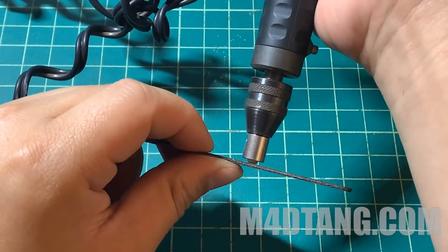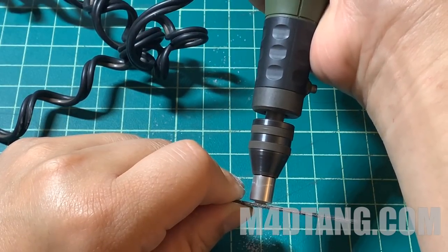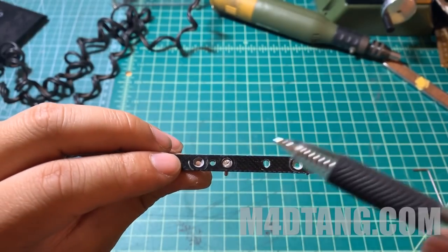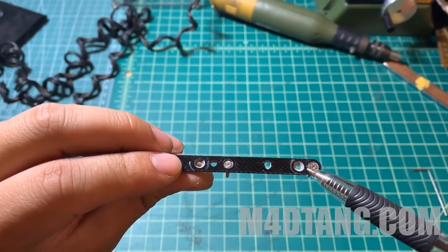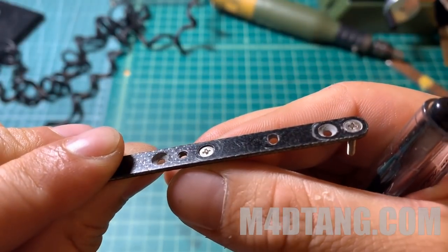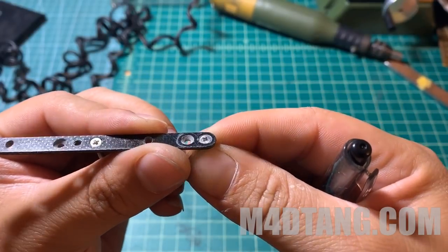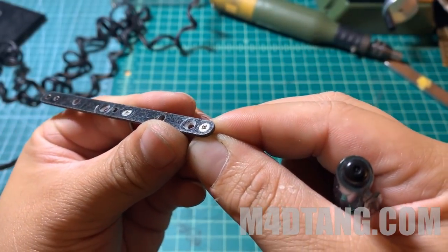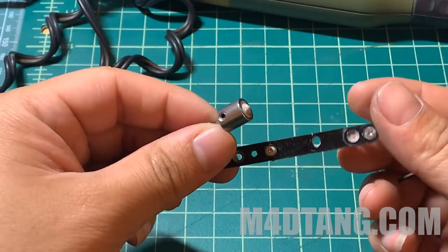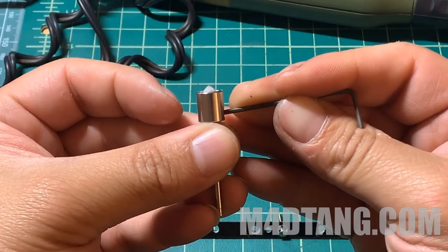Let's take a look at the side view to show you how it works. When you are drilling, the stopper will block you until you reach the destination size. I made two different sizes of countersink holes so you can compare. As you can see, the one on the left is really deep — the countersink screw is buried into the FRP plate. The one on the right is a perfect fit, where the countersink screw stays flushed. So it really depends on how you adjust the stopper. If you want more depth, adjust more. If you want more shallow, adjust less.